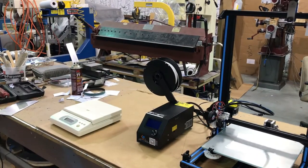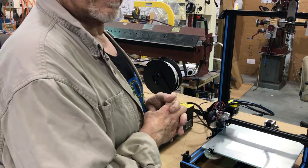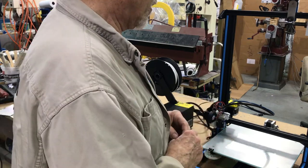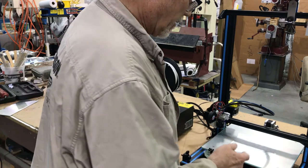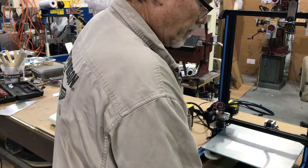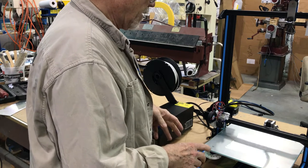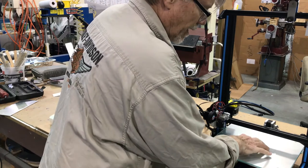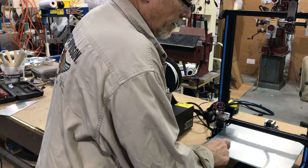Okay, I promised you some shop time. I've got my little CR-10 300 out here; I also have a 500S custom in the CAD room we'll look at in a bit. We'll start with something we see quite often — people using glass as a build sheet. I like that people are seeking out the IKEA mirrors, something thinner and lighter, though I don't think that's the complete answer. You can see I have some aluminum foil underneath here as a shim — this had a little swale in the middle of the table. That's a temporary fix; I have another solution — a lighter build sheet.